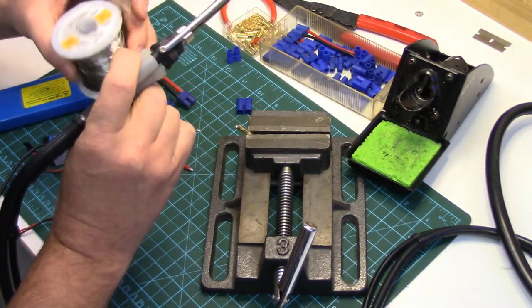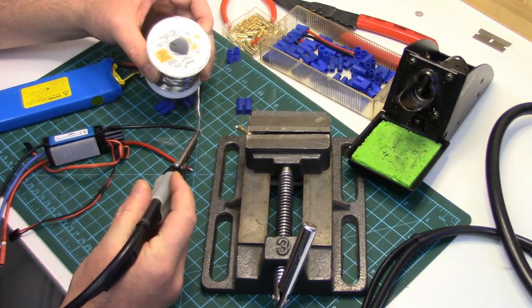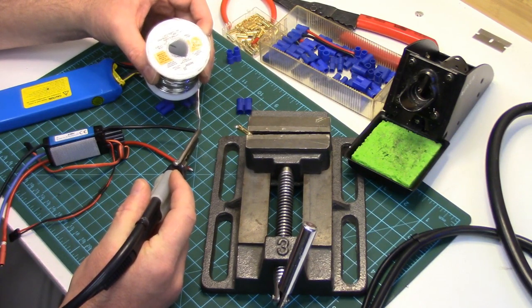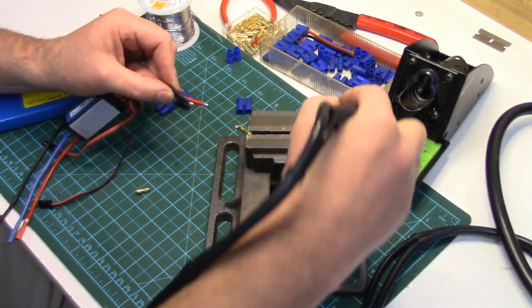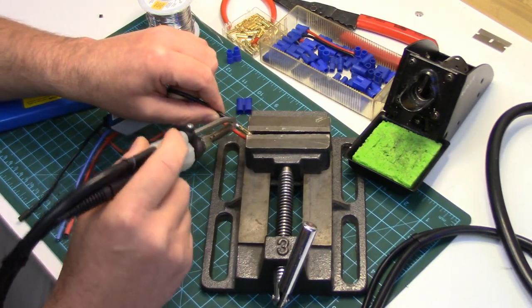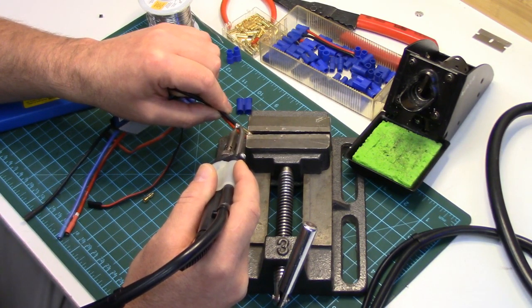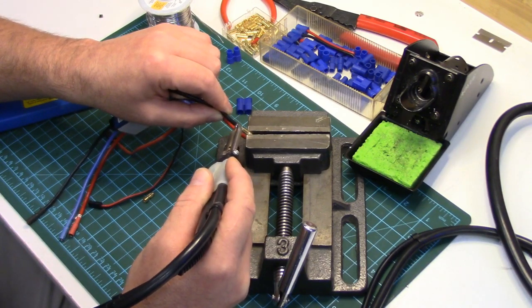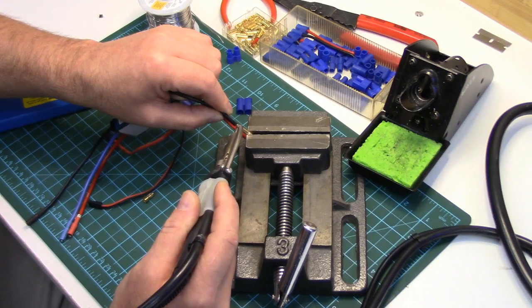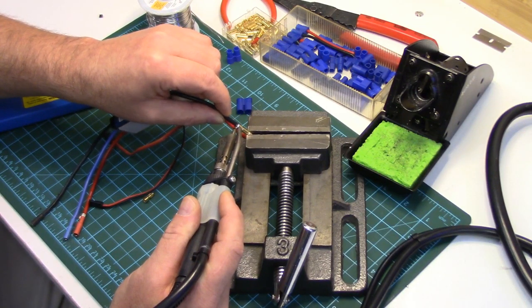Now that we've got that in there, I'm just going to add a little more solder to the wire. If you have solder on the tip between the tip and the component, you've got better heat transfer. So I've got a nice little dollop of solder on the wire and inside the pin. Keep the tip clean and just put it in, apply heat. As I'm doing this I'm pushing down on the wire — not too hard, just enough so as the heat migrates through the wire into the solder in the pin, it will drop in.